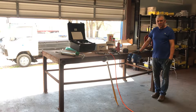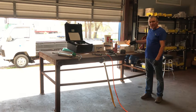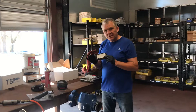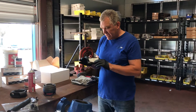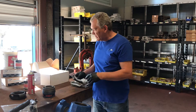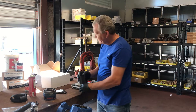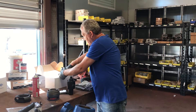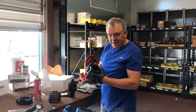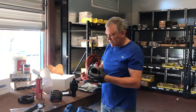This is Shannon with TSI. I want to show you how to assemble a 2-inch plug valve today using our 2-inch standard repair kit. Our 2-inch standard repair kits come with a seal kit that has the expiration date on them, so you know you're getting a good quality seal kit. They come with a plug and a matching set of inserts, both serialized with the heat treat numbers so you know you're getting a matching set.